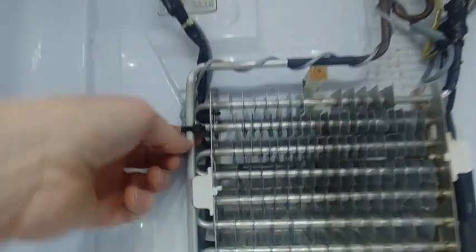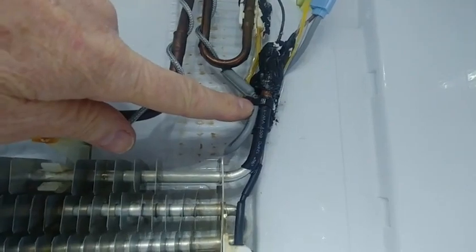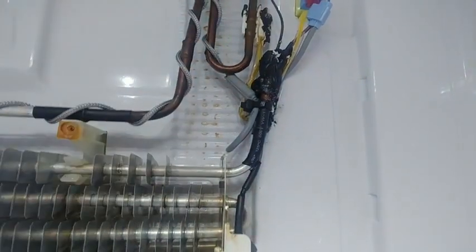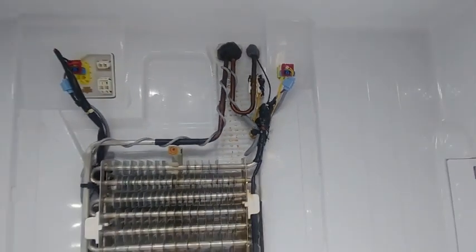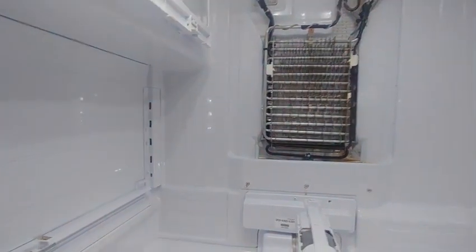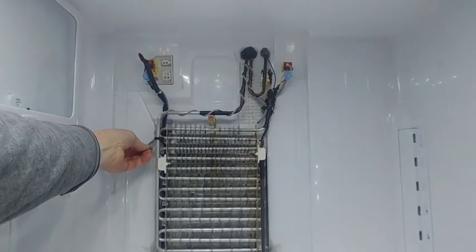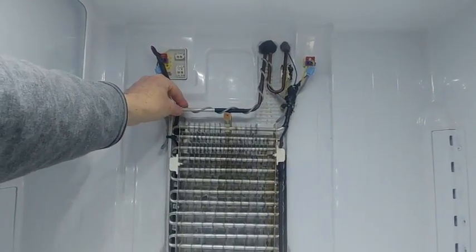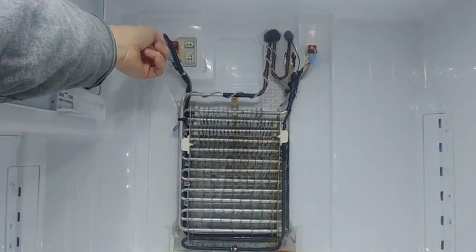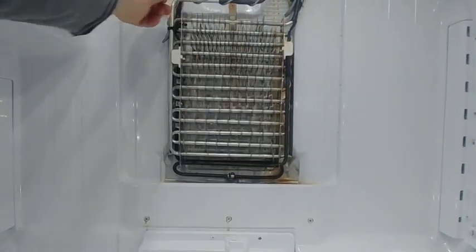I tie-wrapped at either end, staying on the wire part of it — not the heater part — because some tie-wraps aren't really good with heat. The ones I put on are called military spec, but if you're using a wrapping technique like this, you can just stay on the wire part rather than the heating element part. When the system kicks on and heats up the main heater, it'll also turn on this small coil as well.